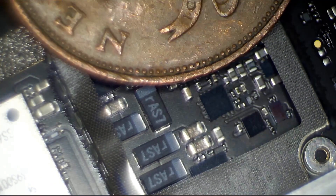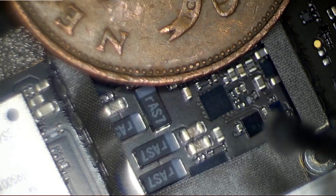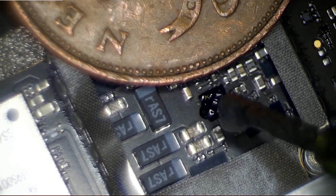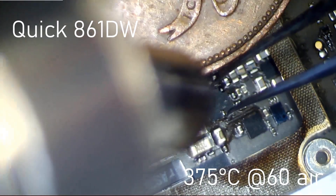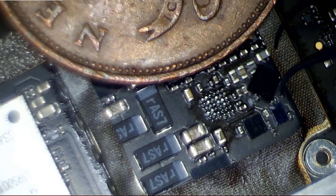We've got new Tristars. I don't normally like to use heat sinks, but on this occasion I feel it's going to add that little bit extra safety — just stick a 2p coin there — and that's just to protect those two chips from any excess heat. Take a bit of flux. The battery is disconnected — no longer connected. Dab a bit of that down there, and we're just going to touch up this connection now with a bit of leaded solder.